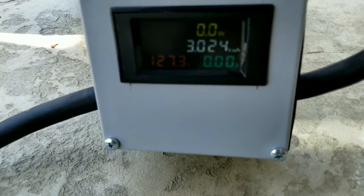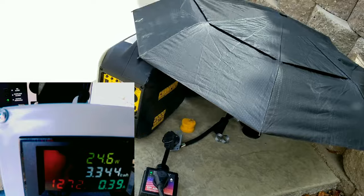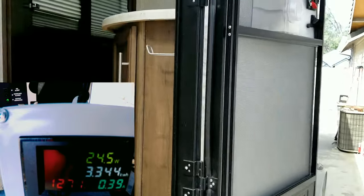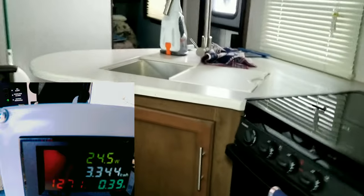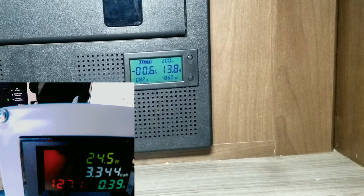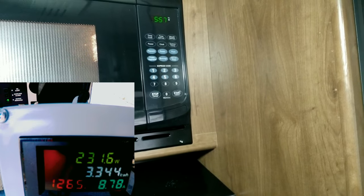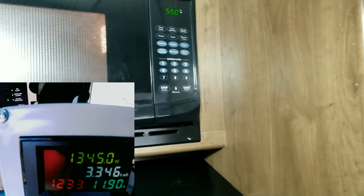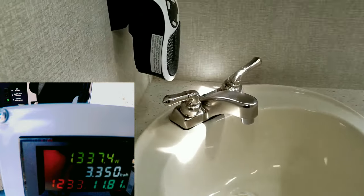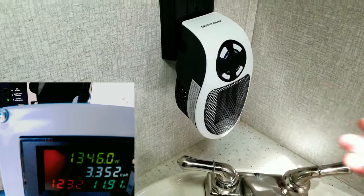Now we'll do the load test, starting with the Honda. Starting voltage is 127.3 volts. We're using my 30-amp service trailer with a 15K AC unit — note this generator will not run that AC unit. The battery monitor shows the battery is full, with the converter drawing about 0.3 to 0.4 amps charging the battery. Turning on the microwave draws about 11 to 11.5 amps — the generator shows a green light and we're at 123 volts. Then we turn on a 350-watt heater, which initially kicks up about 4 amps and then settles at about 3 amps.